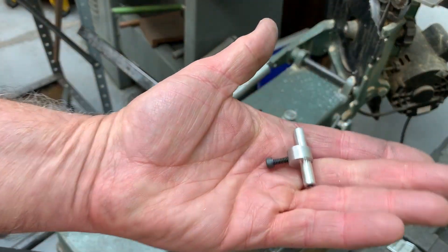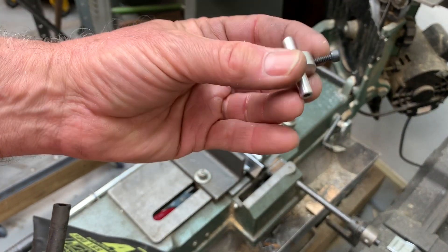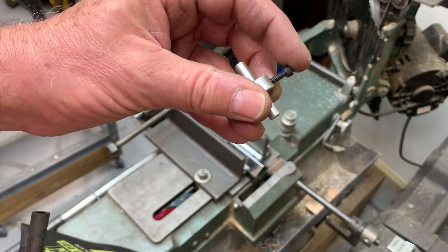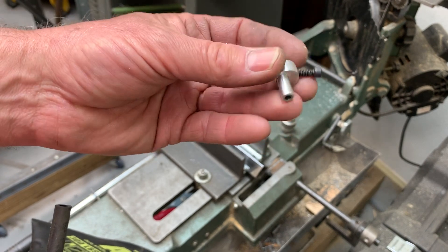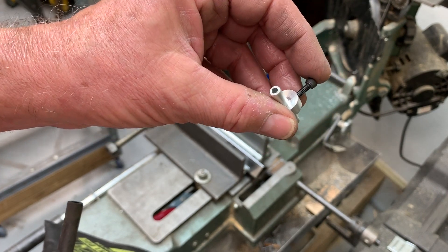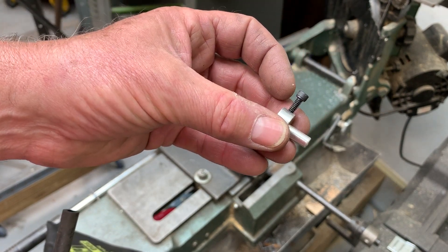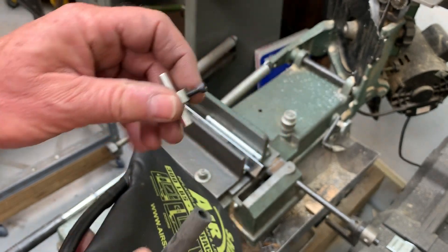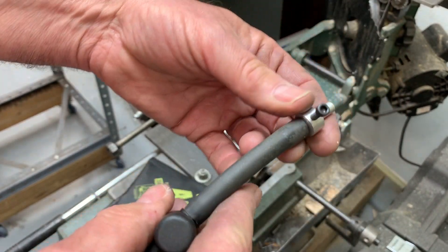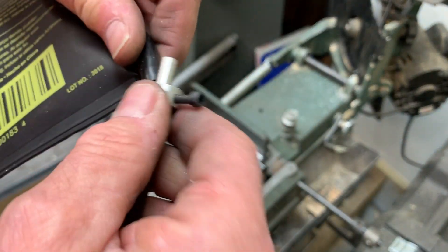The new piece is this fitting, which I will write up and explain how you make it. By turning the spigots off-center like that I get more metal for the adjustment screw, and the hole uses a technique that John Herrmann reminded me of — which is to run a tapered tap down the hole but don't run it all the way through. So when you tighten the screw down all the way it runs into the partial thread and does a good job of sealing it. This simply slips in here; if it had trouble popping out I would lube it or coat it with adhesive, but I haven't had a problem at these low pressures.